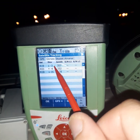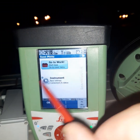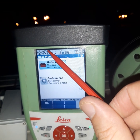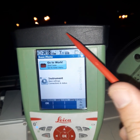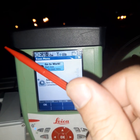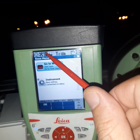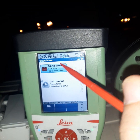This is for the satellite map. If we get 14 satellites and Sigma is 9 and G is 5, that is okay. But if Sigma is 0 and G is 0, that means we don't get any signal. If the summation is 9, we can work. If the summation is more than 4, we can work in GPS. Now it is 10, which is very good.